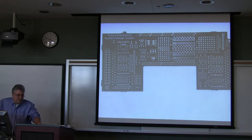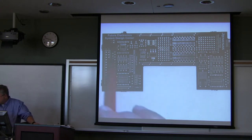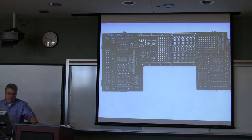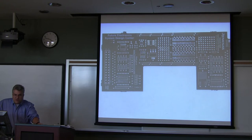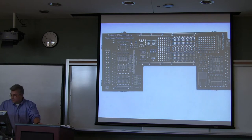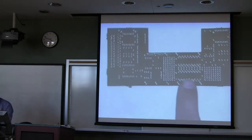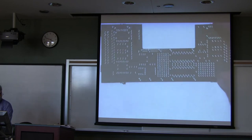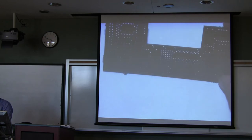Whatever will connect to the Renesas board that you can plug in directly below it, because on the Renesas board itself, the RX62N, it actually has the same area, a place for you to plug in. I'm trying to think, does it have the socket or do you have to put it in yourself? You have to put it in the socket. So you have to put preferably the socket on the Renesas board and then the male header on the extension board. And nothing on the back, but this is probably the area where you're going to be soldering anyhow, right? Because if you have through-hole parts, usually that's where you solder.